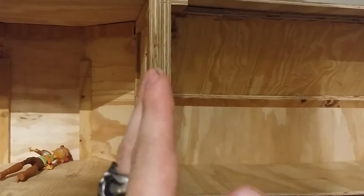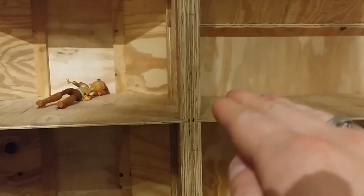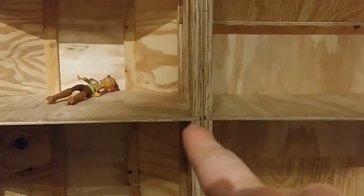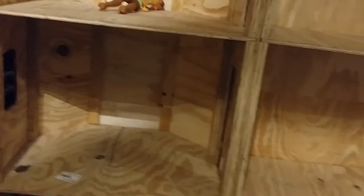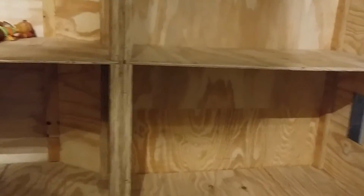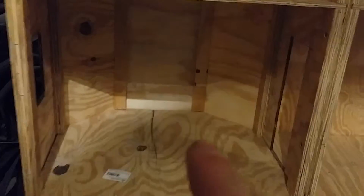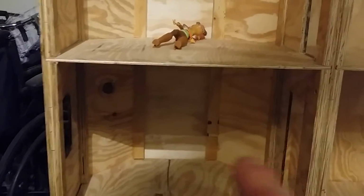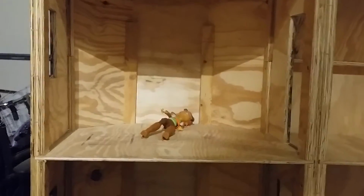So again, build these pieces first, put in your floors, okay? Make sure your floors are nice and straight, and then start putting up the big panels. I would do like I did, these big panels first. These were much easier to cut. And then with these crazy angles, you want to save all your crazy angles for last if you can. Because as long as everything else is straight, measuring off of the things that you have already built to make these crazy things is much easier.